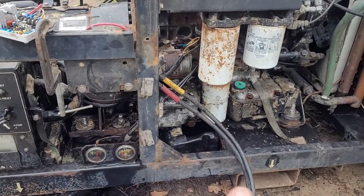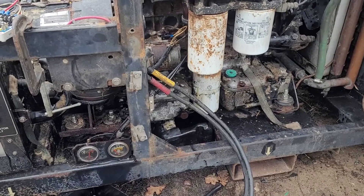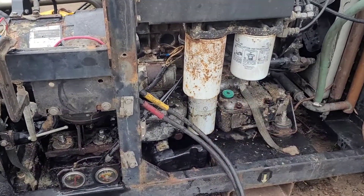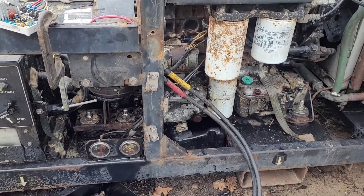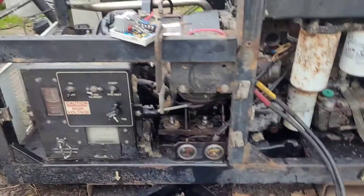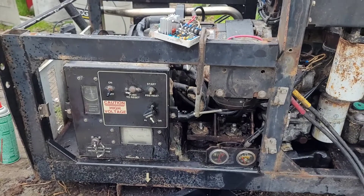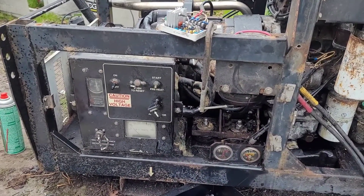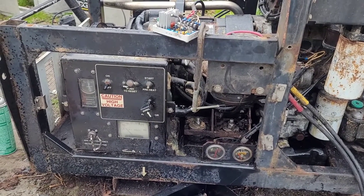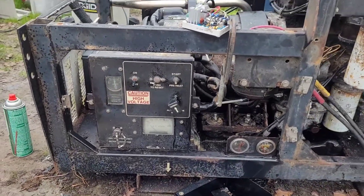The last time I went to run it, after draining another half-gallon to see if it's a blow-by issue or just me overfilling it, as soon as it lit off it started shooting a stream of oil right at me. Running great otherwise, but I'm going to have to put an aftermarket generator controller in this, because the voltage regulator was doing a lot of stuff I didn't realize it was going to do — a lot of stuff passing through it. I'm going to have to swap that out.